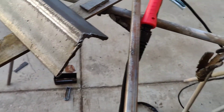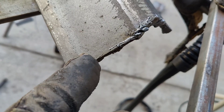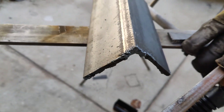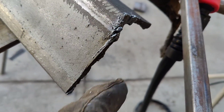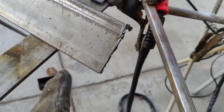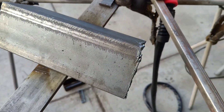Where I had a little trouble — if you see what happens, this isn't really the machine's fault. If you get the slag going on top, like if I started down here and went this direction it would be a lot cleaner, but where I was starting was on this corner. Just to penetrate through was a little difficult, but once I got through you can see it started cutting really nice and clean. I missed a couple areas because I was going a little too slow or too fast — the slag kind of holds me up. A little bit of practice and I know I could get a really nice clean cut. That's actually pretty good for a plasma cutter, better than all the other ones I have.